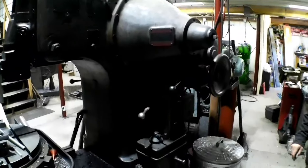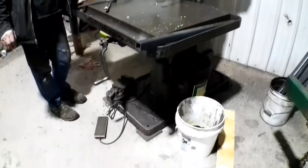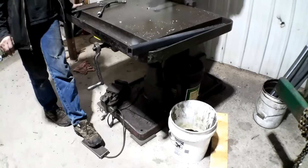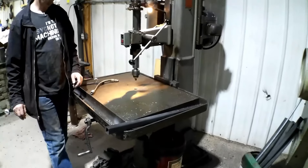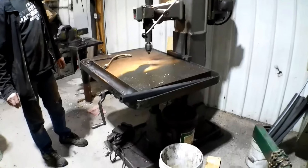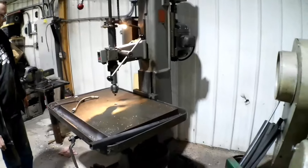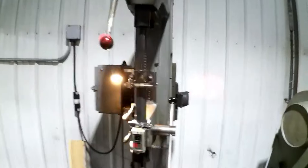Here is my AV sensitive drill — another great machine I'm glad I bought. I've had it for quite a few years. It's set up with a pedal switch that actually reverses the spindle, so for tapping this is an awesome machine just for power tapping. I use it quite a bit. It's got a two-horse motor so it's got plenty of power. I think the biggest I've tapped with it is 5/8, but it's been a great drill.